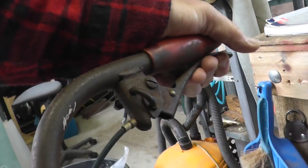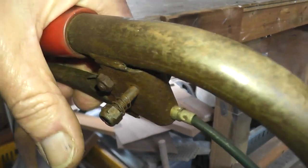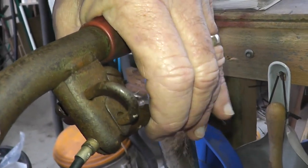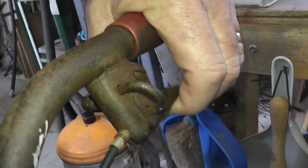A couple of little things — this little lockout here for where you want to start it, it's missing a spring. It's got a little spring in there, and that should shoot out when you squeeze it. But with no spring there it's not going to do that. What it should do is stay lined up with that hole, so when you squeeze it it should drop back in. I'm sure I can find a little spring for that.